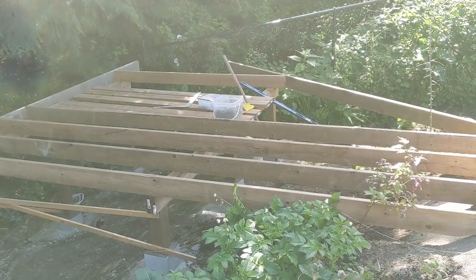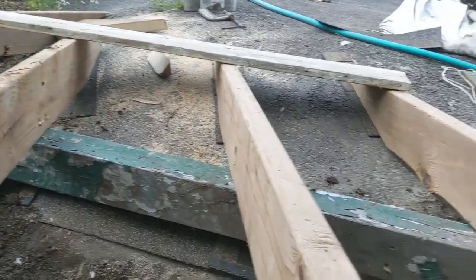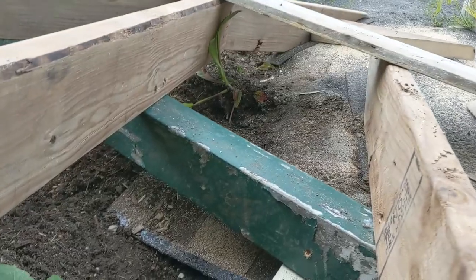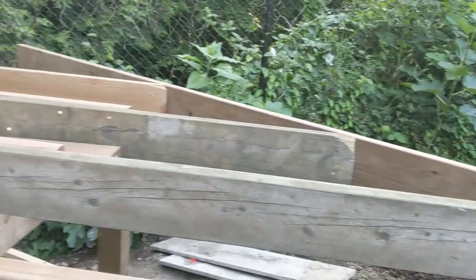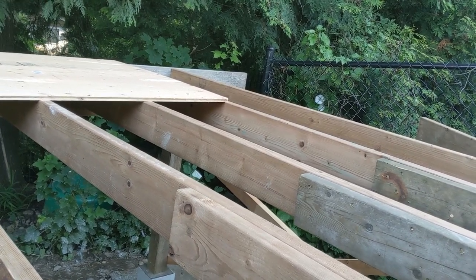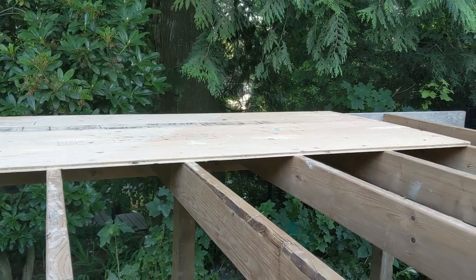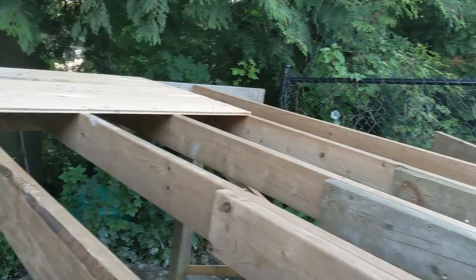Because so far I just have the measurement for the floor, I keep going on the floor. Here I just put an old 4x4 there, treated, to give the extra support for the joists - that way it goes straight out to the driveway. I put the screws in all of them: two screws one side, one screw on the other side. This guy here is just extra support. And later on I'm just gonna clean up some soil from here - that way it's less moisture. I have my joists all up except for one on the corner; just gonna let the plywood overhang a bit. The square looks good, and it took me about an hour and a bit to wrap the floor. This is very strong for a shed.